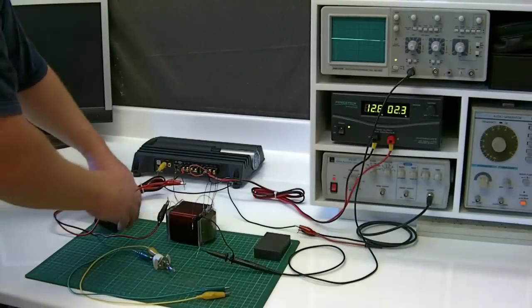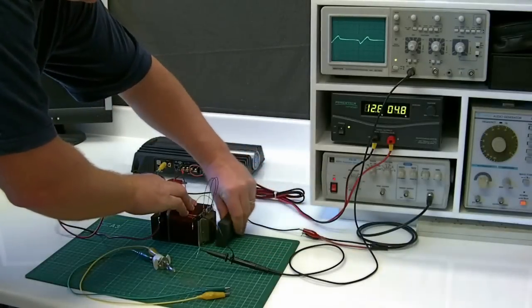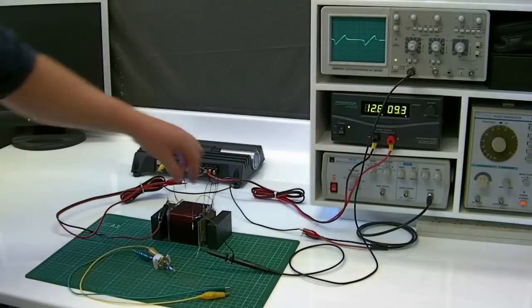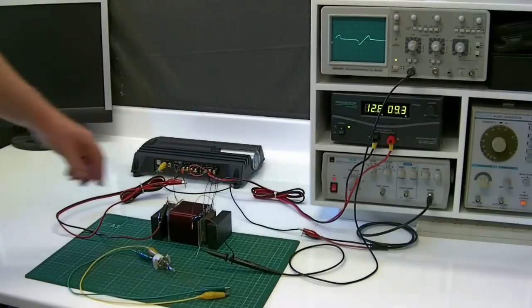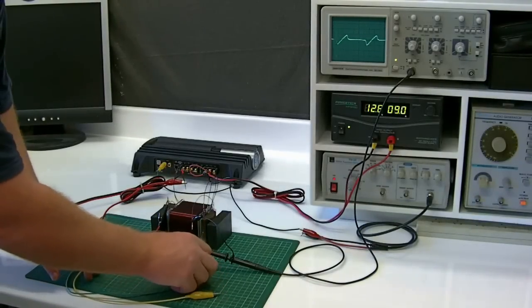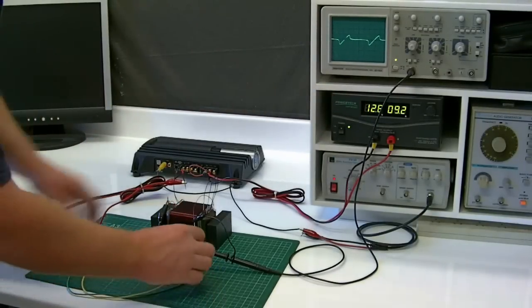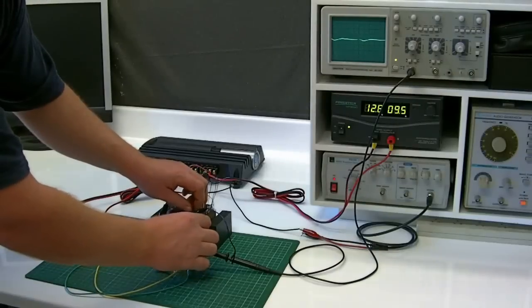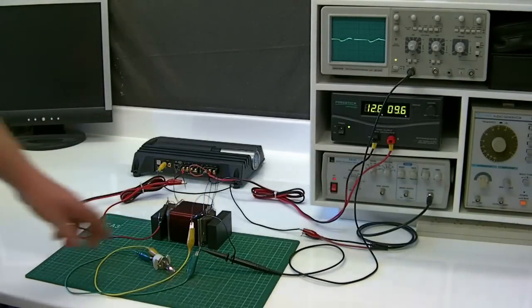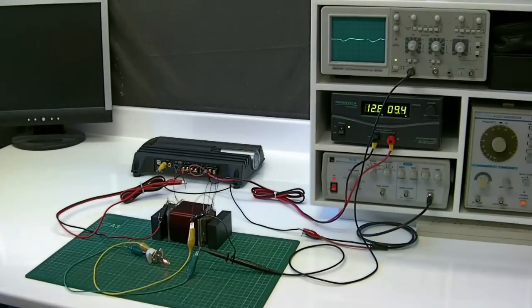What's happening here is when we put the magnets back on, we can see the current goes up. What's happening is the saturation of the core is drawing more current to actually reverse-saturate the core. Something else that's really interesting — put our load back on and if we watch our current draw, there's virtually no change between loading this light and disconnecting the load. It's extremely interesting.